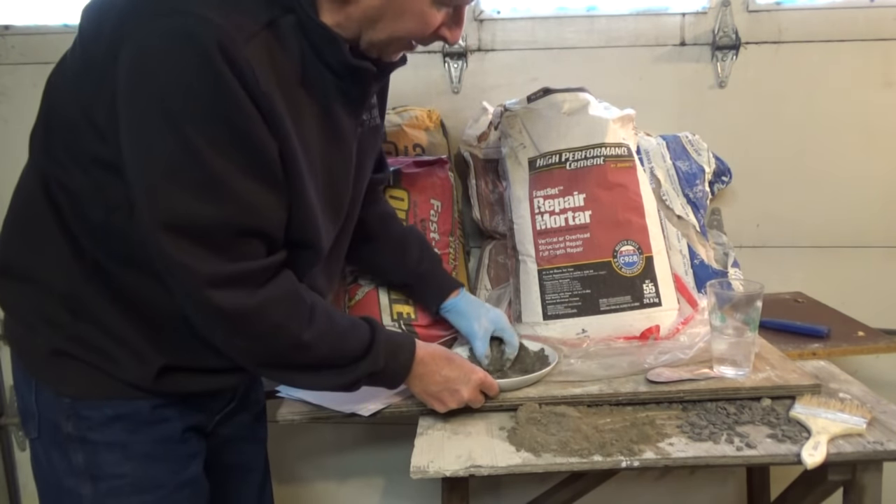I've done a lot of sidewalks over the years. By hand I would take traditional Portland cement, mix it with sand and gravel, and make my own concrete. Nowadays they pre-package it, but when I'm doing a flat sidewalk that weather is going to directly hit, I like to take a trough of traditional Portland and add it to the pre-mixed bag. For our area I think the pre-mix is a little too weak, and sometimes it's already starting to get hard in the store, so I always add a little Portland when I do that.